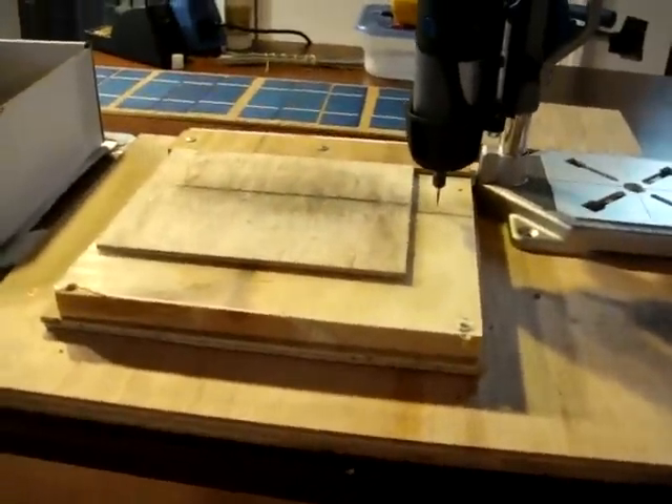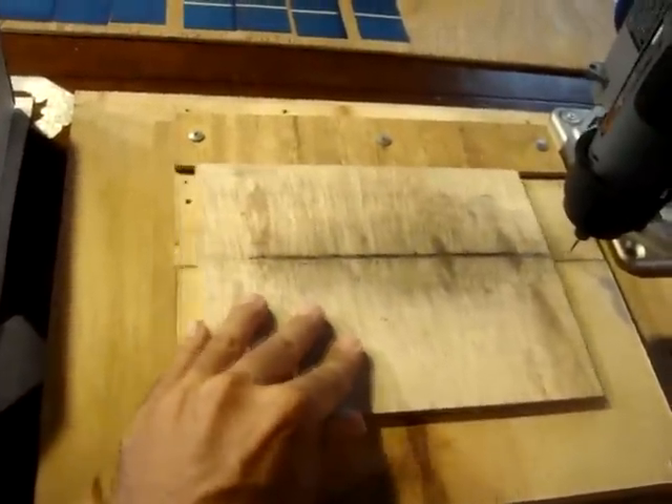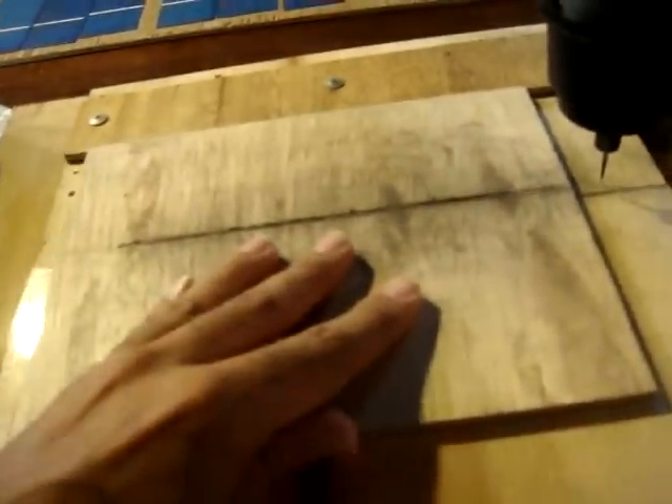What we have is a Dremel tool, and they make these handy drill press accessories for the Dremel tool. I put it on a heavy duty plywood baseboard for stability, and I made a little stage here that elevates the solar cell up to the cutting bit. I put a little edge bar here so the solar cells will be on this piece of wood — the edge bar kind of keeps it straight in one plane. I put a piece of lexan over top of the wood because wood on wood had a little too much friction; it was hard to slide the cells. This lexan helps the wood move smoothly underneath the cutting bit.